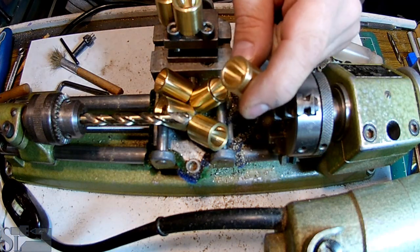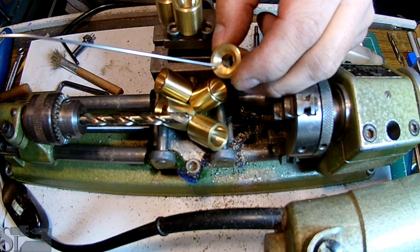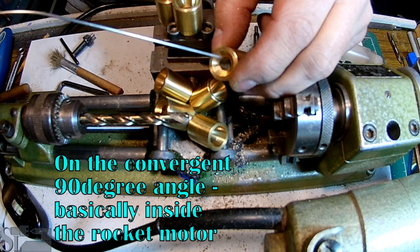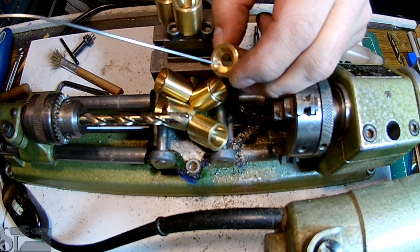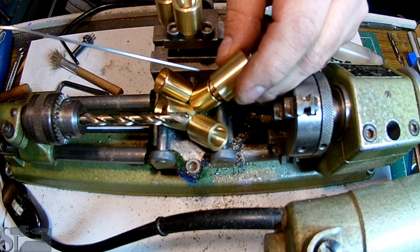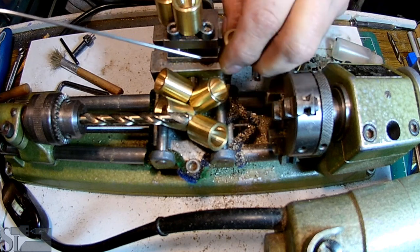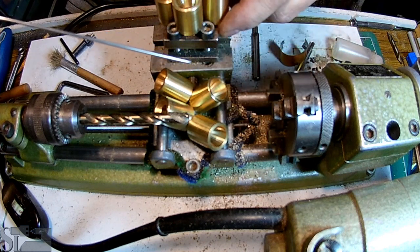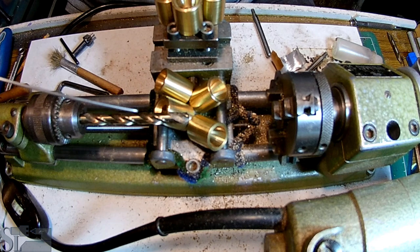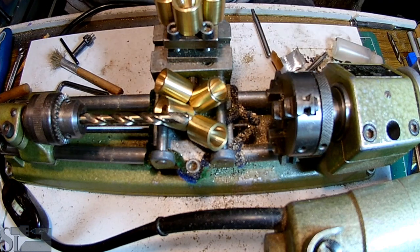If you're interested in the specs, there is a 90 degree angle on the internal area — this is where the gases from the combustion are forming — and this is the linear flow area. We have a 17.2 millimeter diameter and a bell-shaped exit. The bell-shaped exit was formed using a form tool — basically it was formed by this glass drill bit.